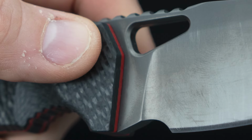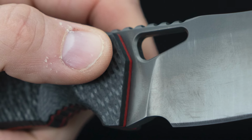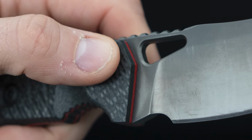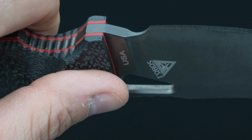And you've introduced, and I personally also, and I have some examples, I always design with these scallops. Now, I know some people end up flaring. I always bevel. Yeah. And I like beveling because it keeps the knife thin through the grip area and it allows you to get tight and it doesn't create any hot spots. And to me, you've nailed it there. So talk to me a little bit about that.